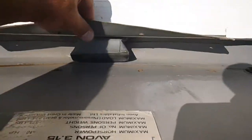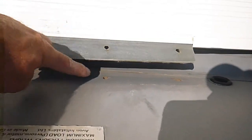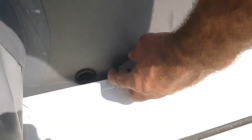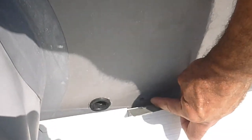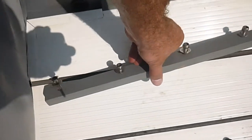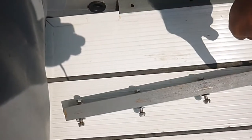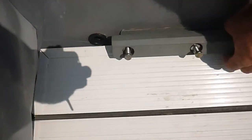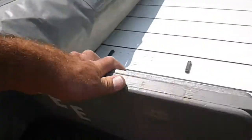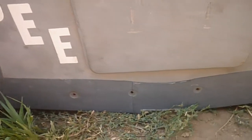For the last part of this floor, we need to come back. These holes will match up with the holes in the transom. I've got the floor all the way in the back position and the holes within the floor piece line up with the holes in the transom. You're going to take the nylock nuts and washers off this side and put the bolts through the transom, then put the washers and nuts on this side.